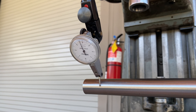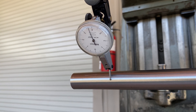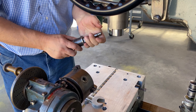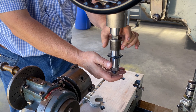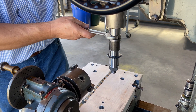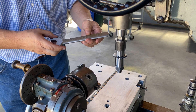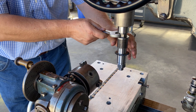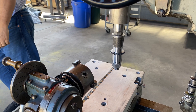It doesn't matter whether you're using a Bridgeport, Kearney & Trecker, or whatever kind of mill you have — you're going to need to do the same procedure to set up your dividing head so that it's at the correct zero angle, 90-degree angle, whatever you want to call it, to the milling cutter. The Moore is pretty specific — it takes a 31/32nd wrench, but the room for that flat in there is not very big. This nice old alloy Super Inch got a hair trim right there. 31/32nd — that's the flavor of Moore.